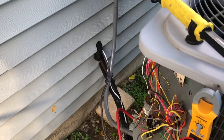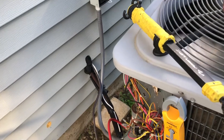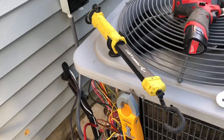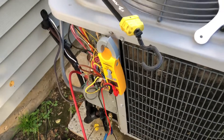My superheat's at 7 degrees - I'm done charging it. I have 145 on my low side, 263 on my high side. I'm gonna clean the coil for head pressure, check the filter upstairs, change out that contactor, and we'll get you some pictures after it's done.